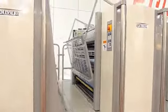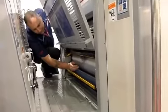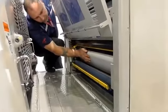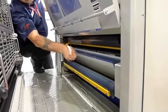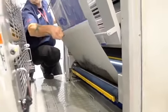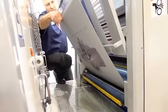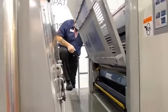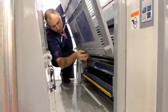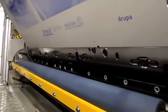This is a good picture of the Sakurai automation. You'll notice that Paul, our press operator, has already moved on to the next print unit while the unit before is finishing its own plate mounting. All Paul's going to need to do is guide this plate off. You'll see there's a slight pause for him to gather himself, and then here comes the plate. This plate would certainly be reusable, although in most cases it's going into the recycling. You'll notice that the bend of the tail of a Sakurai plate is very, very slight — we do not require a plate bend at all. You're going to take a completely straight plate and drop it down over the pins, as you can see.